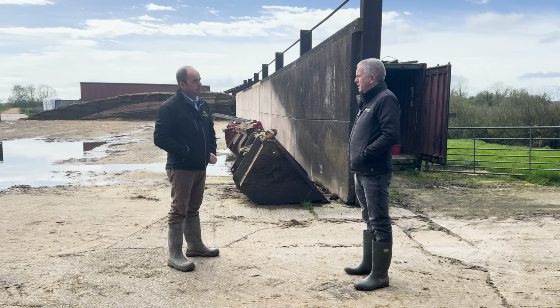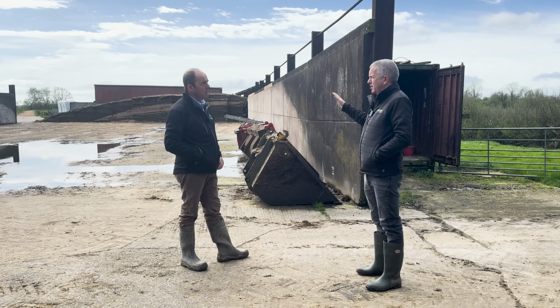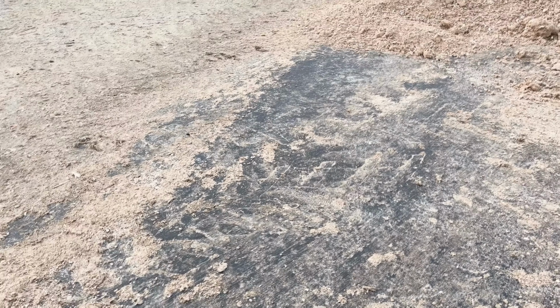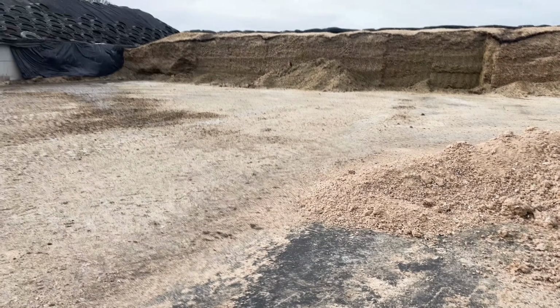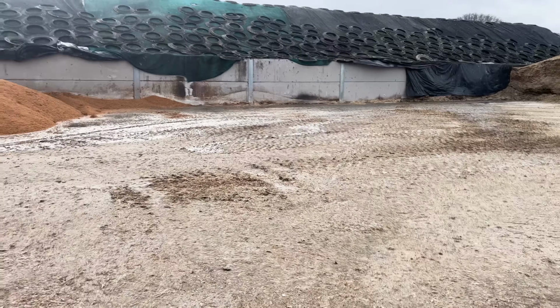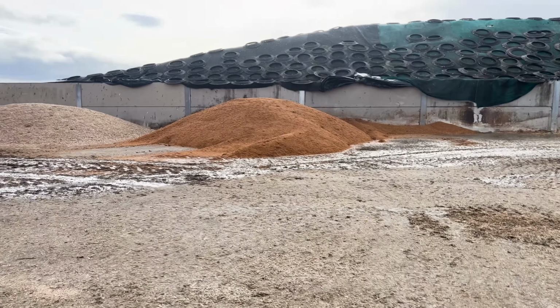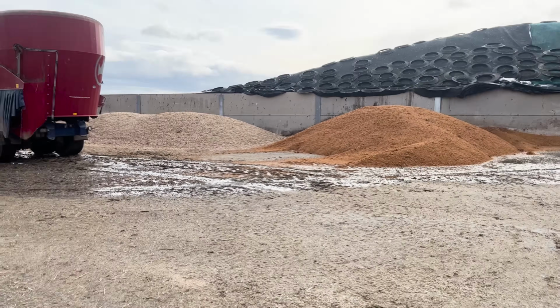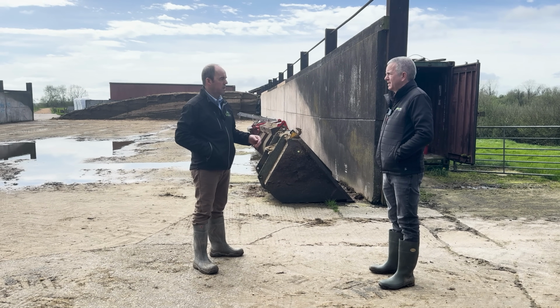Okay. So we've seen also in some places tarmac or asphalt. Yeah, tarmac and asphalt. Asphalt is the dense, fine, so it's more like a sand grade tarmac. We've been working on projects with asphalt silage pits for quite a few years now. Does it last? I was a bit sceptical of it when it was first introduced, but having seen big loading shovels pushing on it, it just sits there, slipping on top of it, and it doesn't fail.